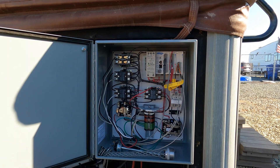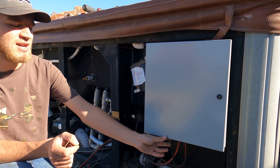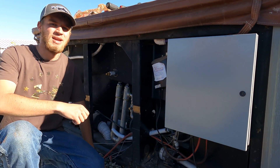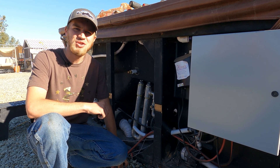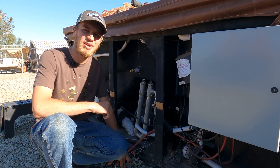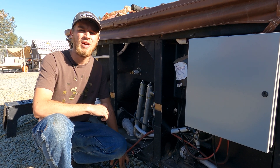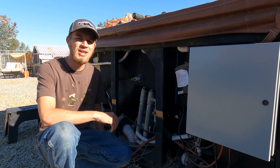In the process of programming that PLC I made the mistake of running the heating element without water flowing through it. So after about two minutes that heating element just decided to quit working because it burned up inside once it boiled away all the water. As a result I needed to make a new heating element.